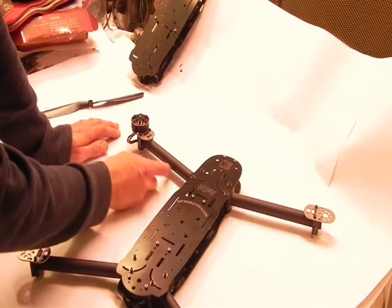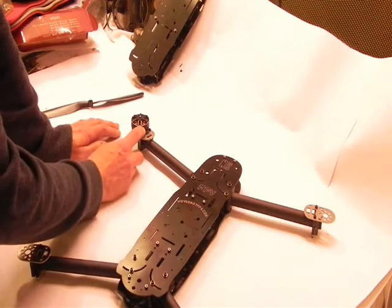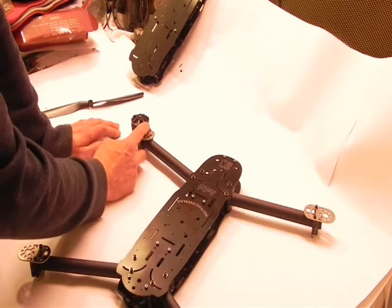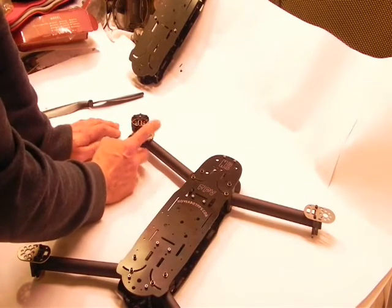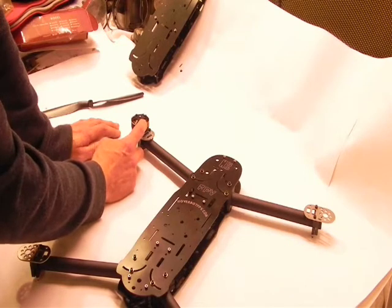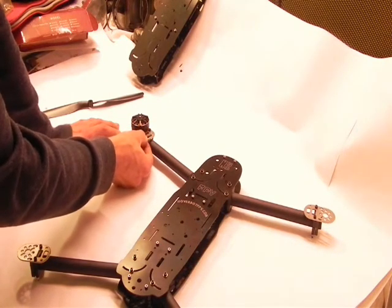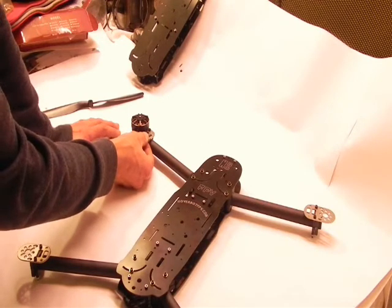Then you'll start chasing back all your wires and digging apart all the inside of a quad, when it could be just that you have one longer screw than the others, or that your screws are just too long. So that's important. You want to check that first. The screws I'm going to include are 6 millimeter, and that is enough to cover the 1/16th of the motor mounts or the doubled carbon fiber mounts.